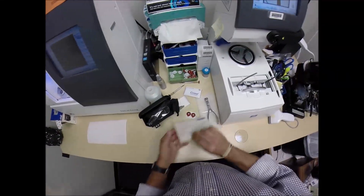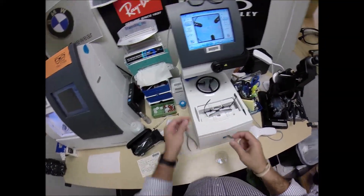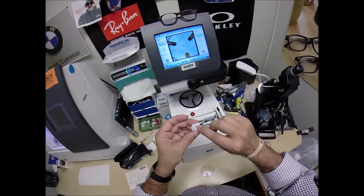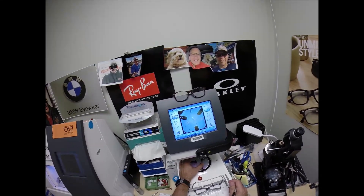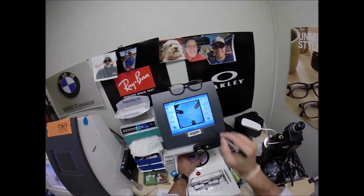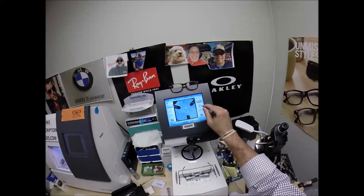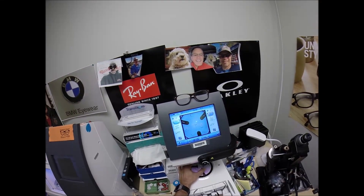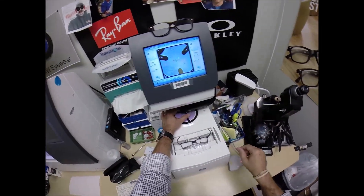I'm going to place the lenses onto the platform — this is the blocker, or as I like to call it, Jenny from the Block. I attach two double-sided adhesive stickers to your lenses: the black side is the sticky side. I line it up onto the first block, place it on the platform, do the same for the second one. That silver button is a magnet — it attaches to another magnet in the arm. I place that there, get everything lined up, and hit the button. The arm comes down and places the block onto the right lens. Same process for the left lens: same pupillary distance, same optical center height, nothing needs to change.